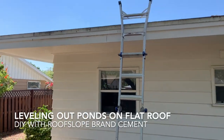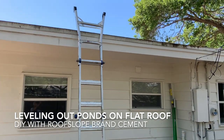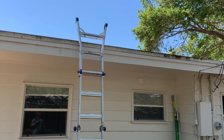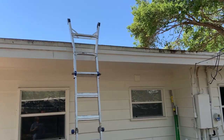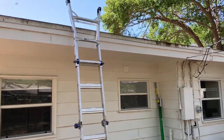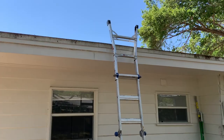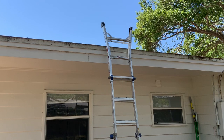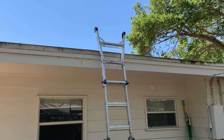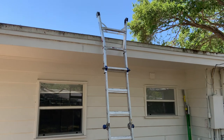This is a flat roof, or I should say slightly sloped. The problem here is that the architect who redid this house and flipped it a few years ago didn't carefully check the roof slope. The roof slope is a little bit low for the type of roofing they used, which is modified bitumen. This roofing is supposed to have a half-in-12 pitch or larger. It does work on this roof, but we noticed a bunch of ponding, which is where water stays for more than 24 hours.